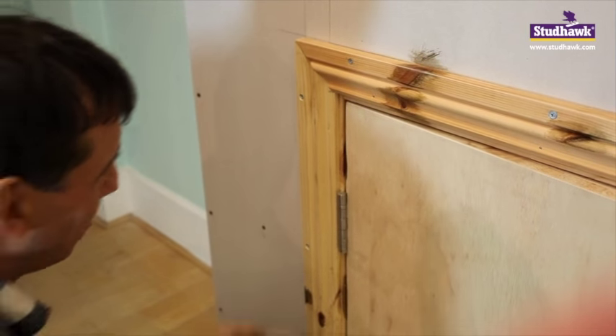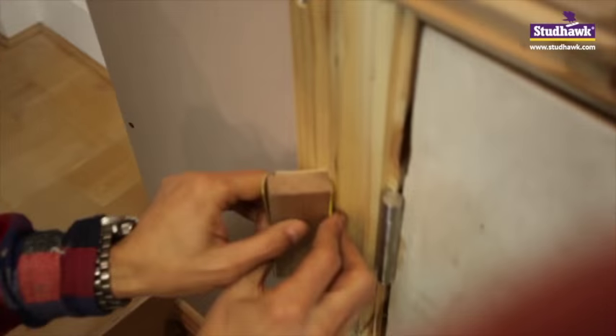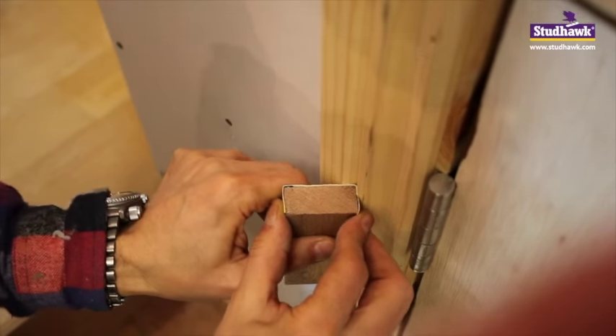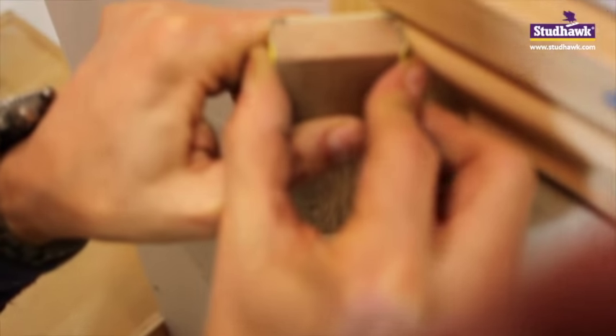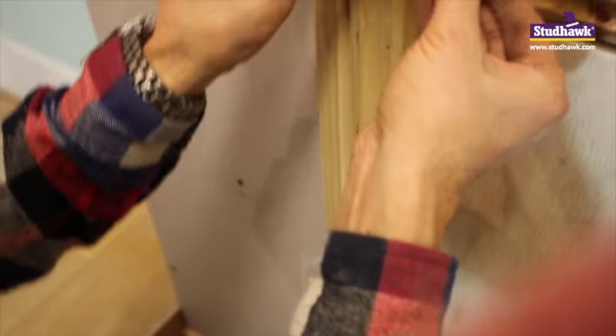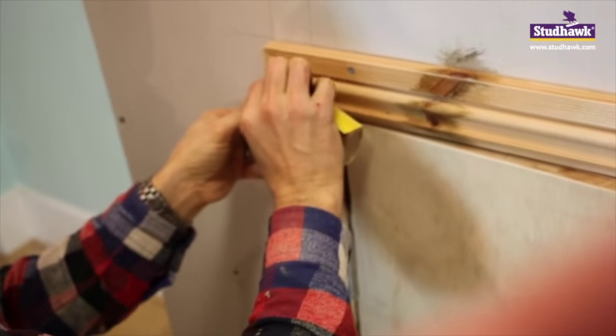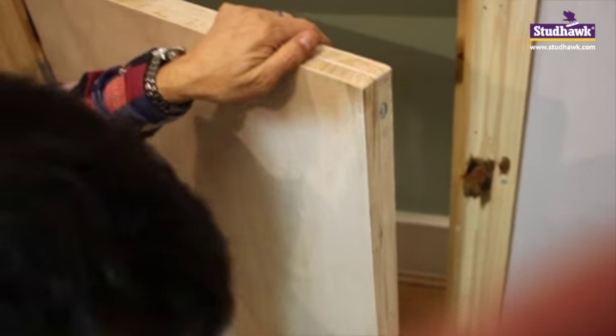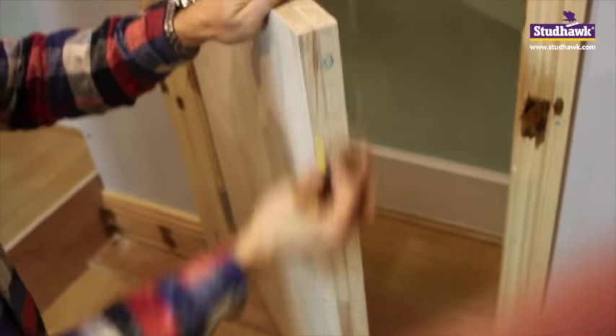Sometimes what you get is a bit of a burr. Look how that block fits in there — vertically down there, you'll see it's going in there. So I can take two faces at once, which is going to come in handy, especially when we're sanding between coats. Nice little pencil round. Checking it. Sanding it out.